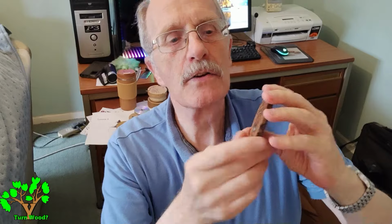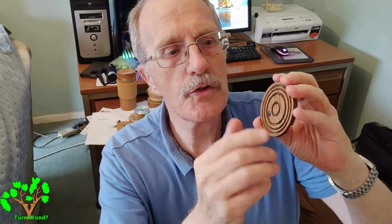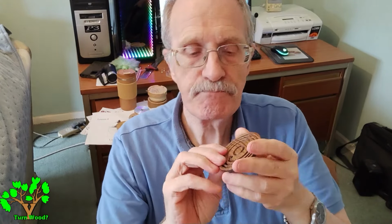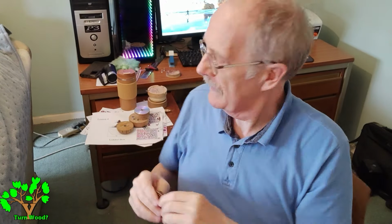I found the difficulty if you do an eccentric face there, turn it round and do another eccentric face, that's when the problems start. The concentric bit helps you maintain pressure against a double-sided tape, but if you do an eccentric version, there's more stress involved on the double-sided tape. So it's a question of overcoming those problems. Anyway, to become apparent in the following video.